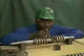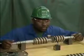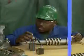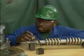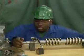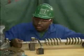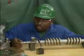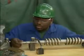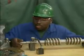rotor. After setting the dial indicator to 0, the mechanic rotates the rotor as he watches the face of the dial. If the pointer moves slowly away from 0 and then back again, the rotor might have to be replaced, depending on the rotor's specifications. If the pointer flickers very quickly at any point, there could be a burr or a dent at that location. Small burrs or dents can be removed without having to replace the shaft.